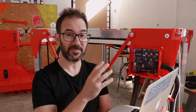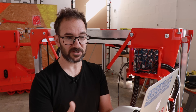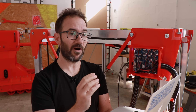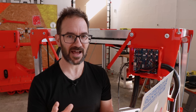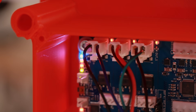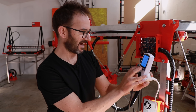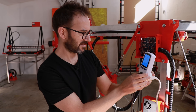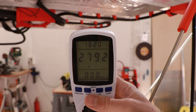I can adjust the PWM duty cycle of the controller of the pads to something like 80%, so it's on 80% of the time and off 20% of the time, so it cannot go full power — which I think will be enough. With the duty cycle at 80%, it draws 15.2 amps, still a little high, with 3 kilowatts. But this is only an issue when warming up. When it's hot, it uses almost no power.